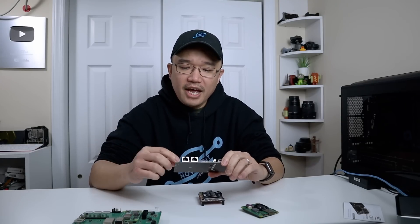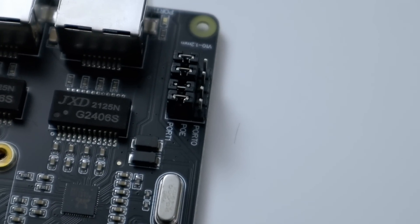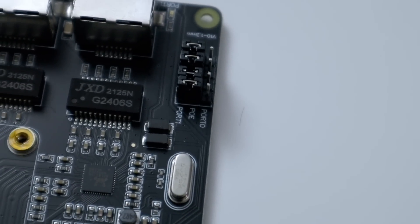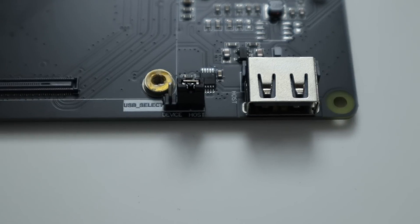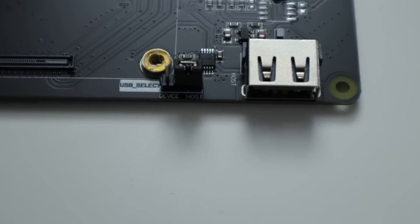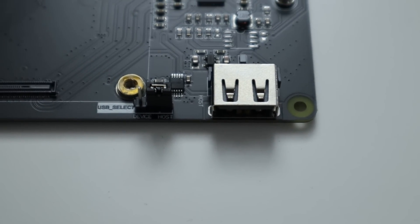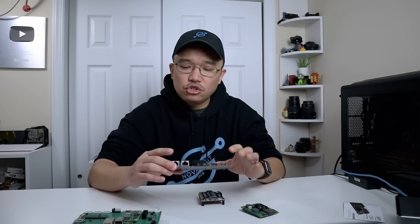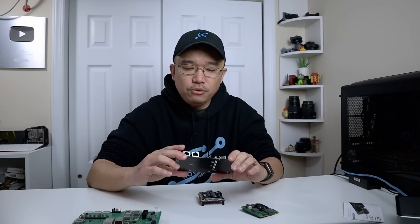Moving to the other end, there are four jumper pins for PoE. You can choose whether PoE is coming from Port 1 or Port 0 by moving all four pins to the selected port. On the bottom side, the USB connector is there for USB, and there's a jumper pin for device and host mode. If you're planning to program the board via RPi boot, you need to set that jumper from host to device and also set the middle jumper for RPi boot.